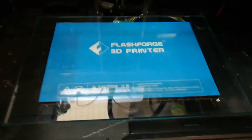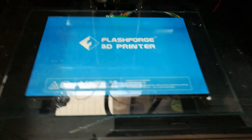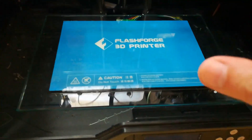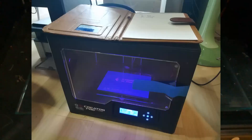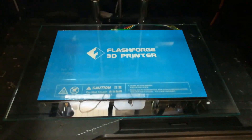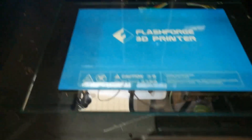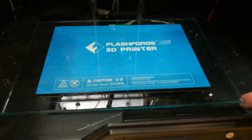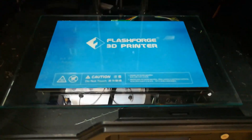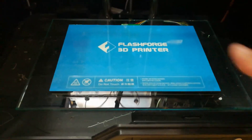I noticed that the travel of the print head can go quite a bit farther than would be allowed by the blue platform. So I ordered a piece of tempered glass — 300 millimeters by 200 millimeters — and adhered it to the blue plate with hairspray. I sprayed it on, stuck the glass down, squeezed out the bubbles, ran it through a heat and cooling cycle, and now it's pretty stuck. I'll cover it in blue tape since we're printing with PLA. One thing I also had to deal with was that in software I couldn't account for the five-millimeter thickness of this glass — Simplify3D has a lot of customizability, but I couldn't find a way to make a five-millimeter offset everywhere.